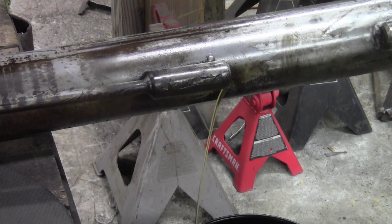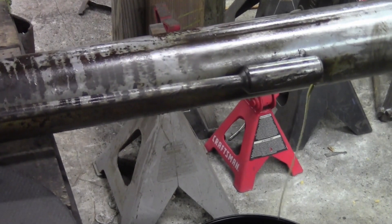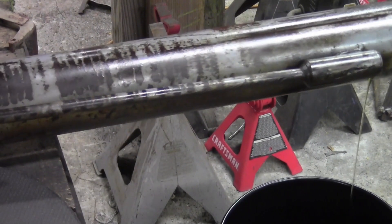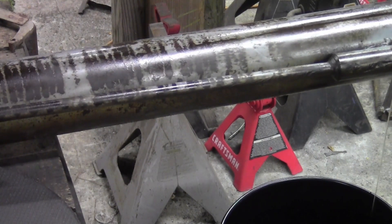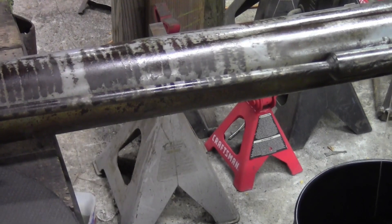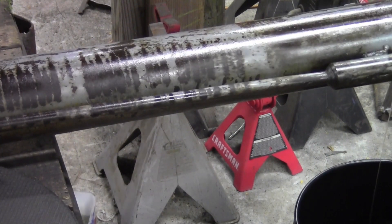This thing is starting to get a little off balance, so I'm going to push the cylinder back a little bit. A dual action cylinder is basically the same as what would be in a log splitter, or anything where it has hydraulic function in and out — a tilt cylinder on a forklift, a side shift cylinder on a forklift, a steering ram on anything that uses a hydraulic steering ram. It puts pressure one way to create work, and pressure the other way to create work in the other direction.